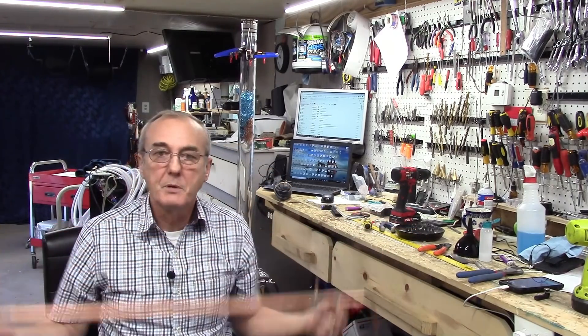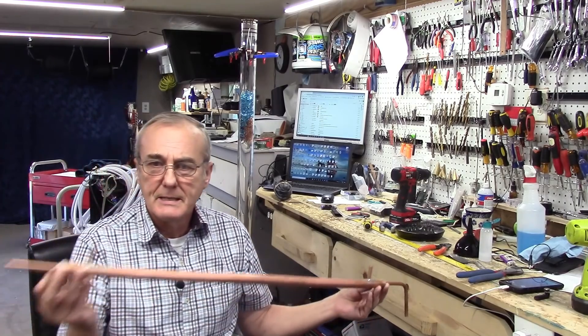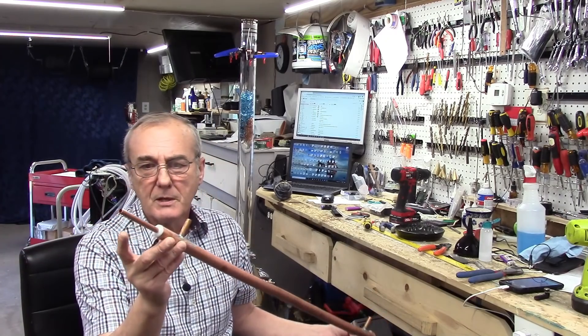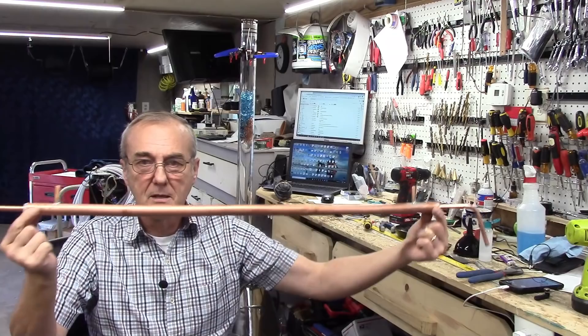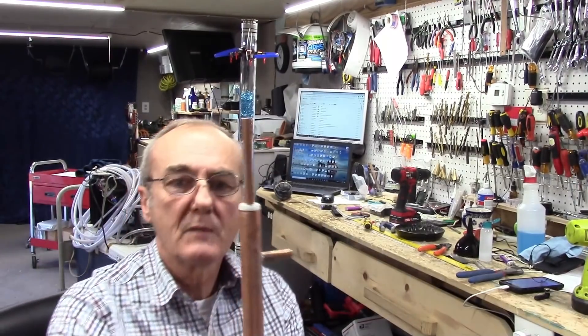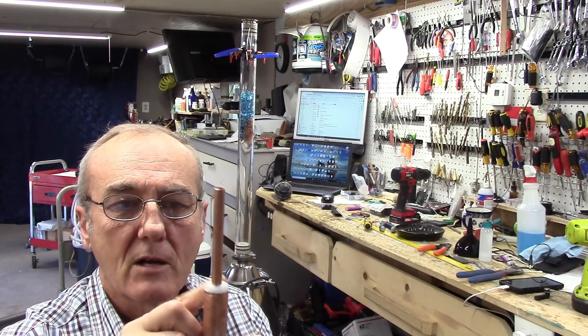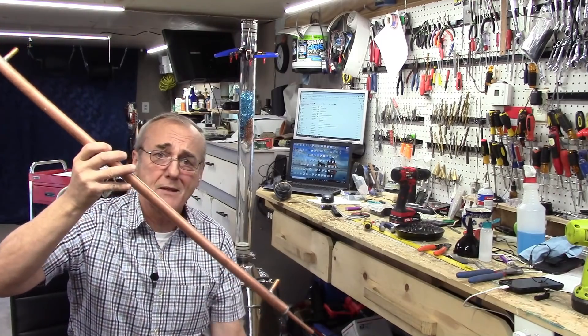Cold water will go in the bottom and come out the top, cooling the tube inside and turning that vapor back to liquid, which will drip out the end into our parrot so we can start testing proof. But before we get there, we've got to make this thing work. Since we've never run it before, I did a few checks at the very beginning and found out that this thing leaks. It's put together rather well — Bill King sent this to me and did a great job designing it and drilling the holes through the glass. But the challenge is that water is always going to find a way out. It has these plastic caps on the bottom where the copper goes through and seals inside the jacket, but they leak — not even under pressure, just with water in there. So I went to my Dremel and shaved that collar down to the same size as the pipe, because we have to resolve that leak before we can go any further.